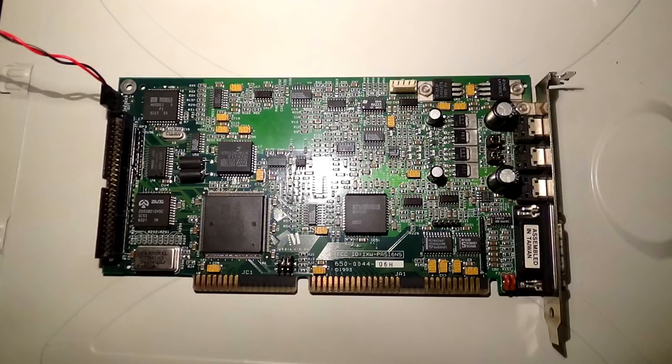This highlights something that emulators wouldn't be able to give you, the subtle differences in supporting circuitry. I don't know which of these two implementations is technically the more correct, but it's quite interesting given how both cards use the exact same FM chip. So they should make the same waveform, there should be no difference. Yet, even in an audio editor, there's a blatantly huge difference in the shape of things.